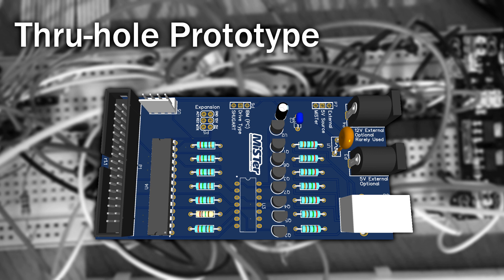I haven't tested any of these prototypes yet, so again I'm deliberately not showing any detail, but I'm hoping they'll all be compatible with each other and it won't matter which one you use. What's next? I need to start work by updating the MiniMig core to support this board. To do this, I'm learning Verilog, which is the language used by a good majority of FPGA development as well as actual hardware design. It's also the chosen language for the MiniMig. Verilog has some overlap with other languages like C++, but it's mostly different — it's more about describing how a particular function could be created in hardware rather than in code, so it's safe to say I've got a lot of work ahead of me.